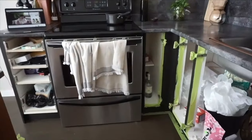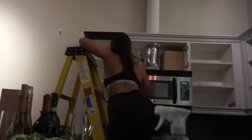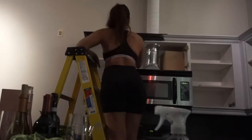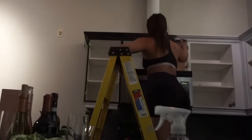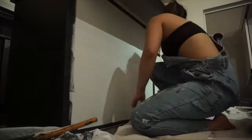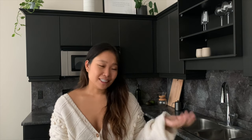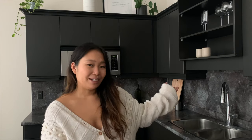Alongside the doors, I also painted the cabinets themselves — just tape off all your edges so you don't get paint on the insides of your cupboards. I mostly used a paintbrush, but for flat edges I used the same small roller. Sand everything down and make sure you get into all the creases with your paintbrush — it was the exact same process as the doors. Once everything was dry (this all took over a month because I was only doing it on weekends), I hung all the doors back up. At one point I scratched a door putting it up, so I took it back down, re-sanded, re-painted it — and now it's back up looking very smooth.